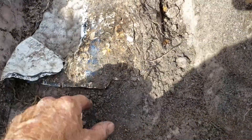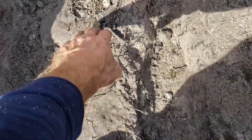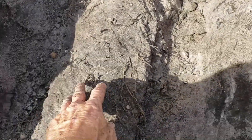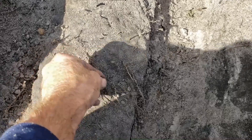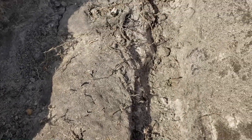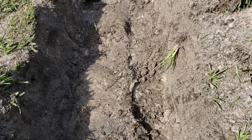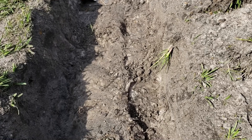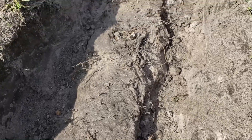There's the center of the pipe. Their logo was just left on and you can see how white and clean that is. It's a 10-foot section. The big thing I'm seeing is tree roots - excuse me, just grass roots - and you can see how many there are trying to get into that system. It doesn't matter whether you wrap that or not - you will never stop roots from entering your system. It doesn't matter what you do, even in a concrete pipe. If there's water there, those roots are thirsty and they're going to seek that water. They'll crack the concrete, whatever it takes to get into it.